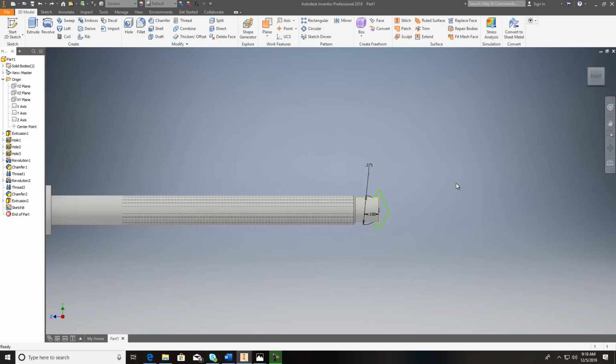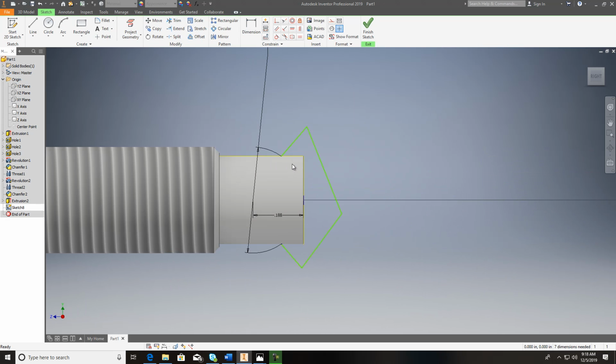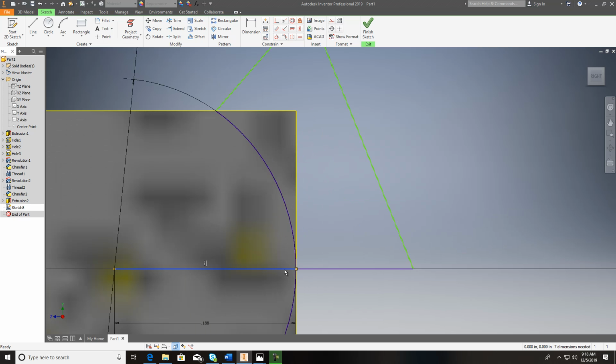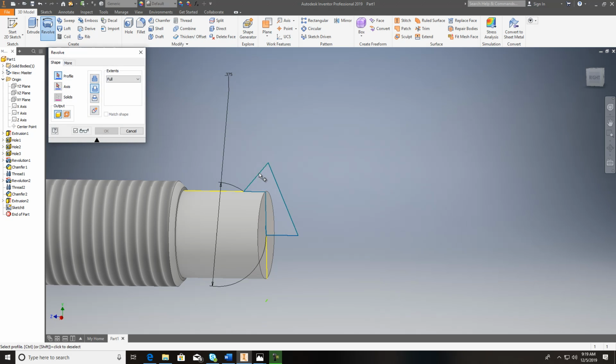We have to do an actual revolve. So we got to revolve half of this thing around. So F7 again. I got to go back in here into my sketch. F7 to cut it. And we'll make a real quick fix on this. Trim. Boom. Let's get rid of all this junk we don't need. That's all I need. And this time, let's do it right. Let's revolve it. Instead of extruding it, cut. Profile is this. Axis. And I don't have an axis line.